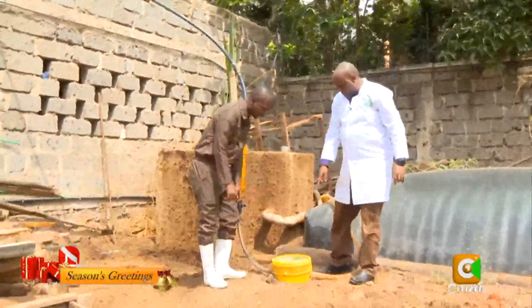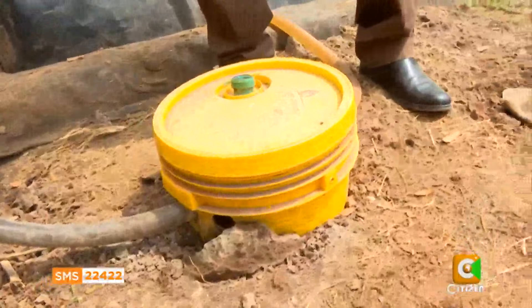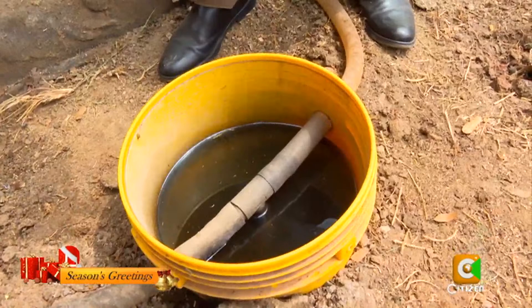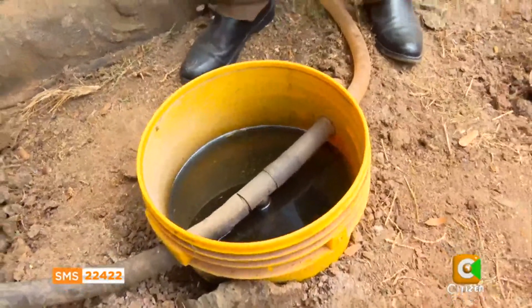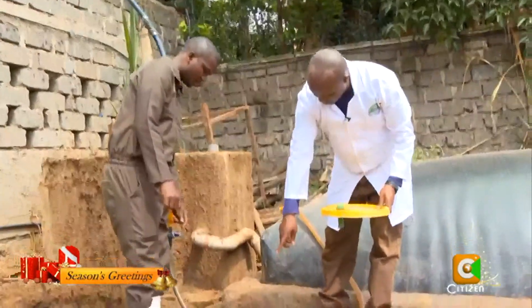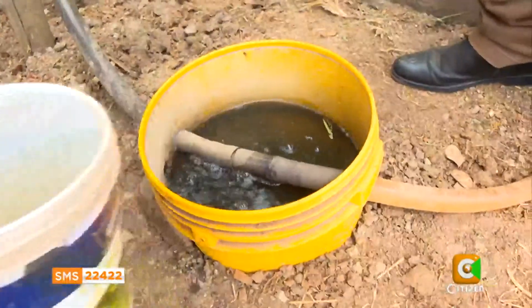What is happening here is the management of excess gas. The best way to release excess biogas safely is through water. When there is excess gas, it pushes its way into this water here — you can see there is water inside. The gas mixes with the water and is released that way, rather than releasing raw gas to the environment, which would cause an unpleasant smell. We need to keep water here at the correct level.